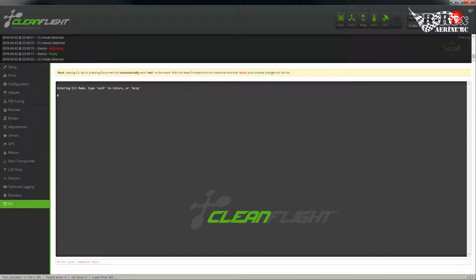Okay, so the first thing that we're actually going to tackle is the motor mixing. Now motor mixing is actually quite simple. To bring up a list of your current mixes, simply type in MMIX. So right now you'll see we actually have nothing listed under motor mixing. That's fine. We're going to add this ourselves.